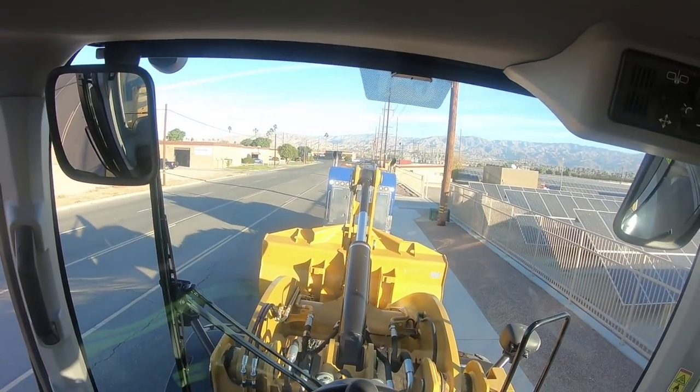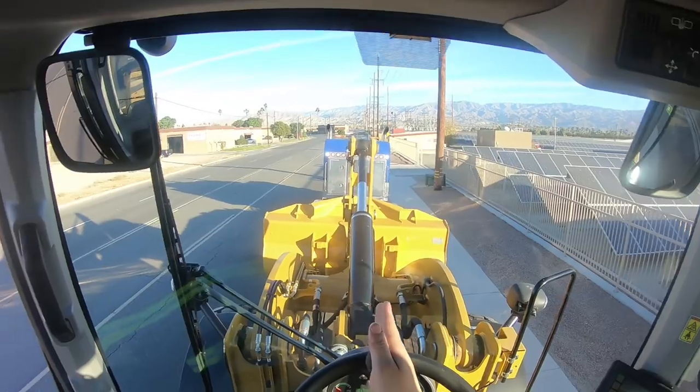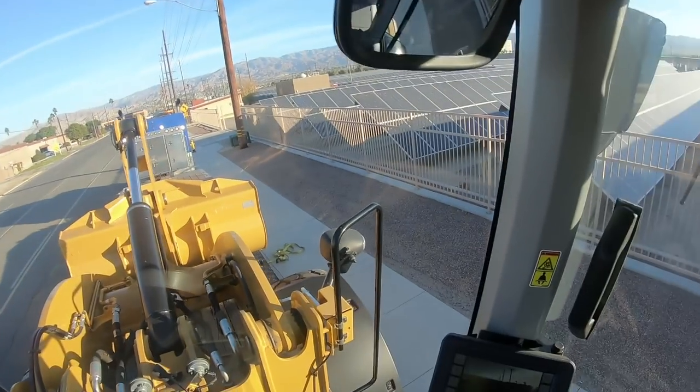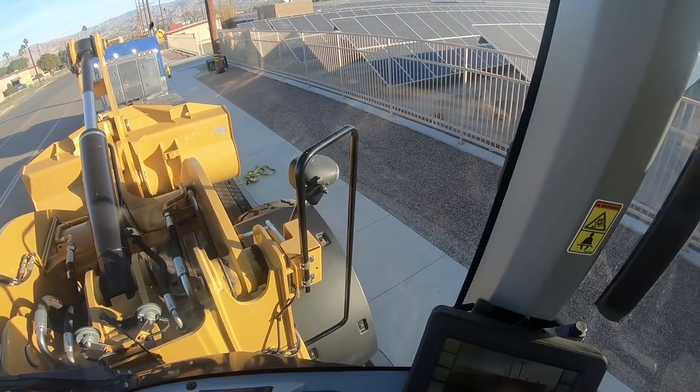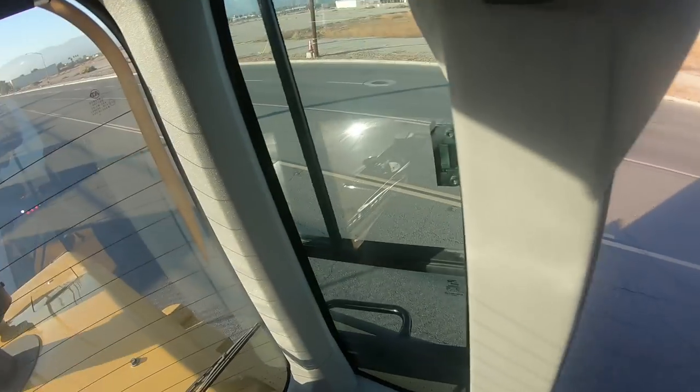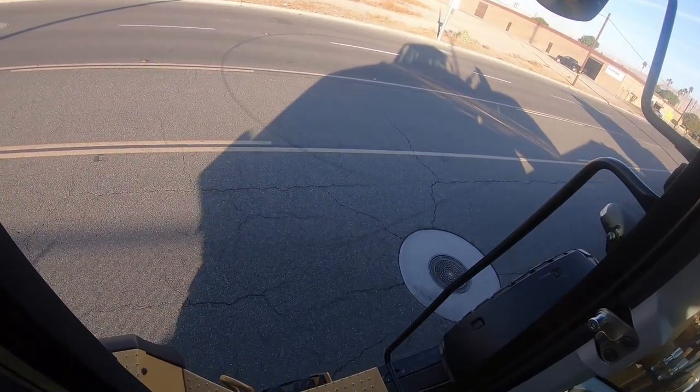You've got to be super careful. A good way to do it is line up the hydraulic ram right here with the center of the trailer — you know your center there. On this one you can kind of see the tires, so we're good. It's also pretty imperative that you just put it on straight, that way you can come off straight.